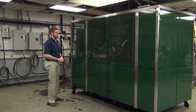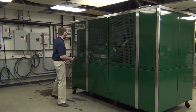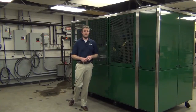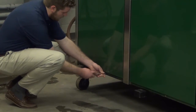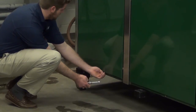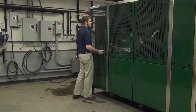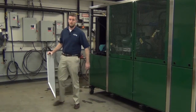Now let's go ahead and remove the panels for the startup. You're going to want to remove both the top and bottom panels on the right side of the unit, both panels on the electrical box, and also the panels on the rear of the unit that will give you access to the filter and sterilizer package. To take the bottom panels off, use your nut driver on the bolts that secure them — each panel has one or two bolts. To take the top panels off, put your fingers in the grommets, lift up, and trim them down, making sure you place them somewhere they won't be bent or damaged.